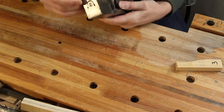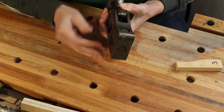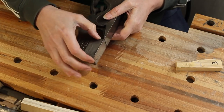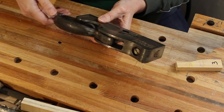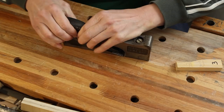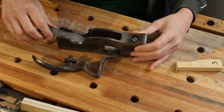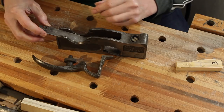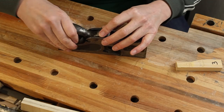It's beautifully made. There's a seam at the front here which you cannot see. You've got to be a little bit careful with these because the blade is exposed. The front of the plane is adjustable so you can adjust the gap for optimum planing. I'll just very quickly show you how the blade works - there's a tensioning knob here. There's also a screw adjuster, which I like because I don't get on well with planes where you have to hammer them - more on that later.